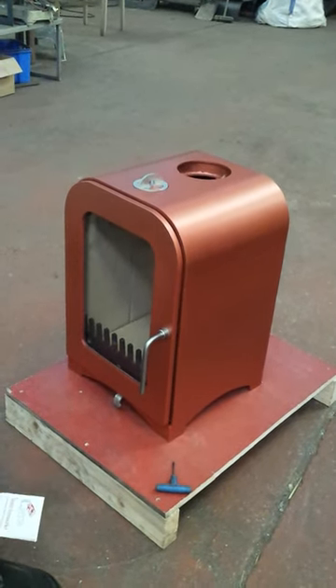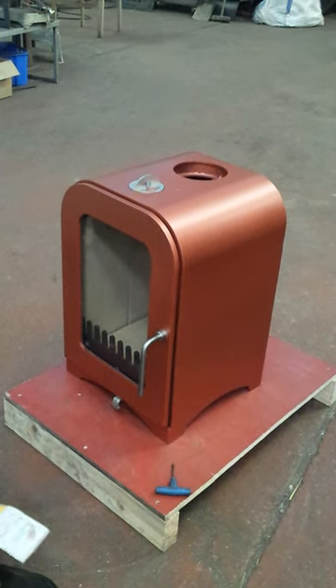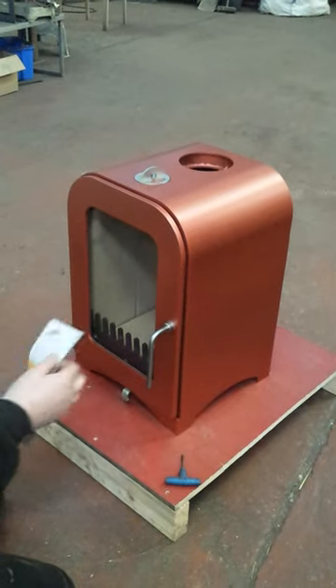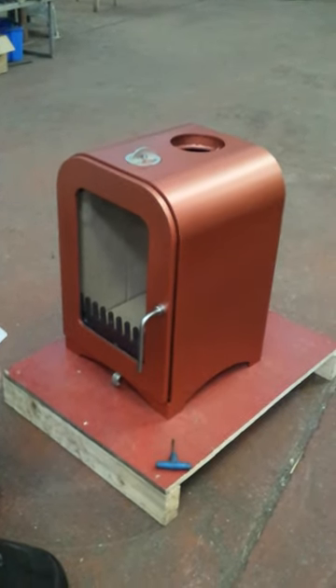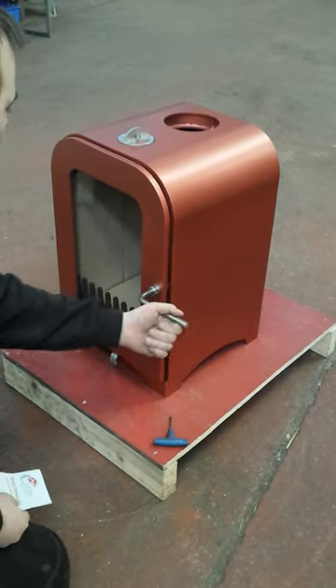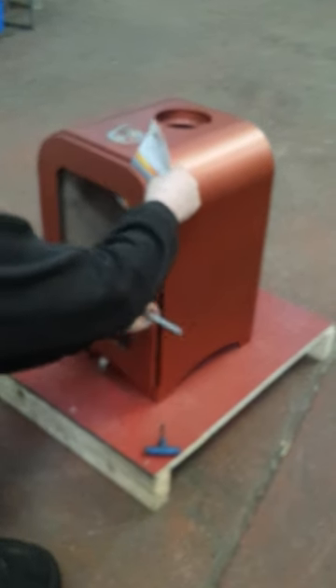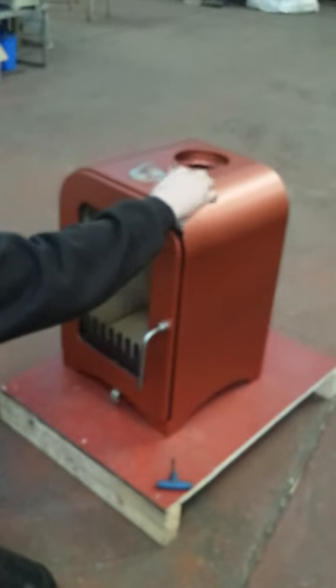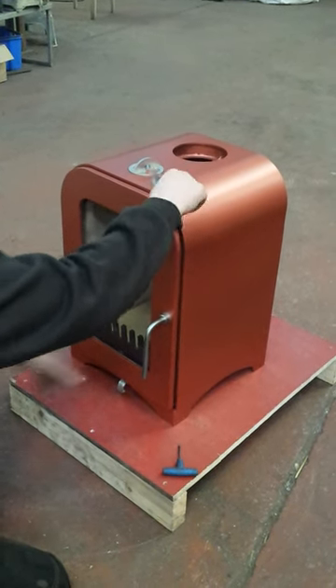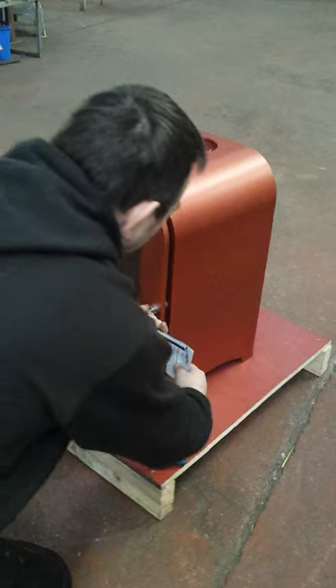Because the rope seals leak air in through the stove door. So if you just take something a bit thicker than a piece of paper — this is just a Vesta Stoves colour chart — open the stove door, place the brochure inside, close the stove door again, and what you want to do is just be able to put a bit of tension on there so the piece of paper or brochure doesn't pull out. Just try that in a couple of places.